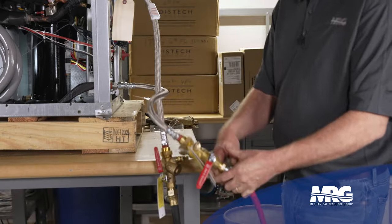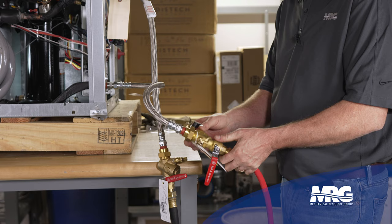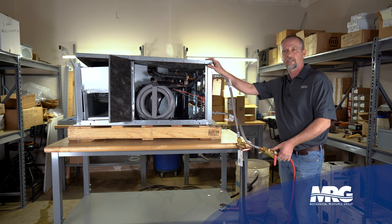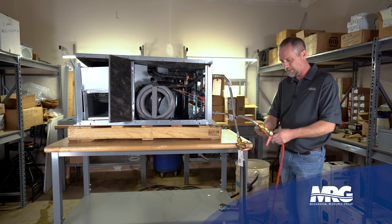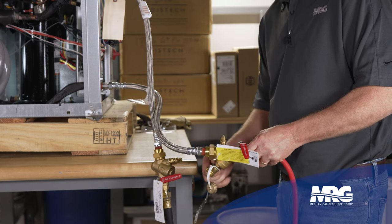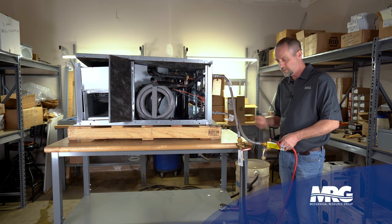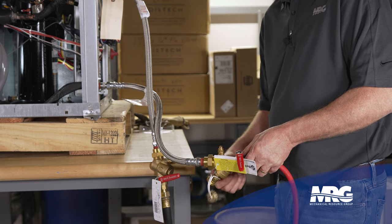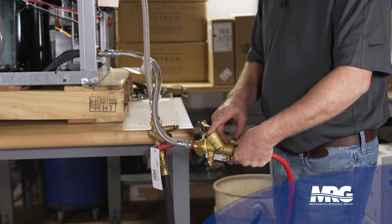The easiest thing to do: turn your water valves off. Obviously turn the unit off first and then shut your water flow off, so the unit is isolated because you're going to get a little water out of this. What I like to always do — usually these units live above ceilings, sometimes in mechanical rooms, most of the time above ceiling — take a small bucket, a two to three gallon bucket, and hook it under this. Take this cap off, open this valve, and that's going to drain whatever water is in here. You don't want to spill water wherever you are, especially not in the customer space. So put a bucket under there, open it, drain that water out.